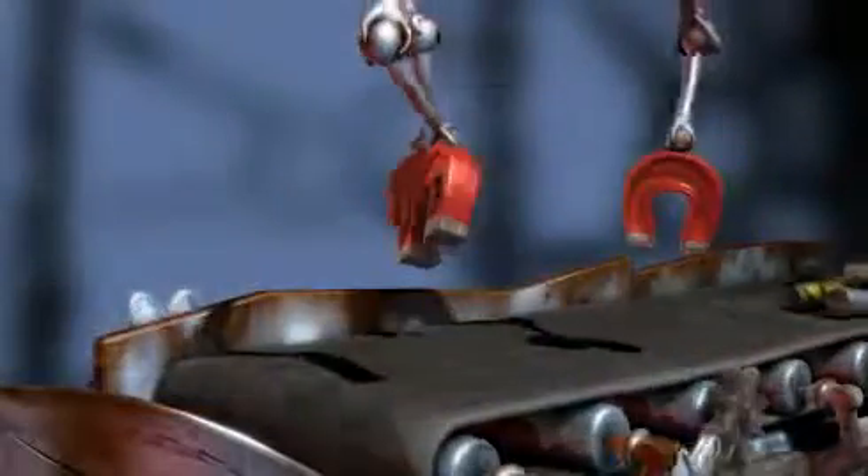The next task is to sort the 3D things from the ballistic separator. To separate the metals, there are magnets to remove steel cans and eddy current separators that work like magnets in reverse to eject aluminium cans.